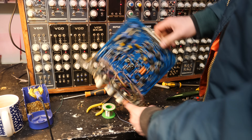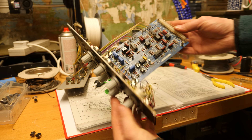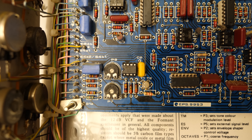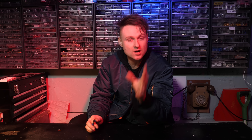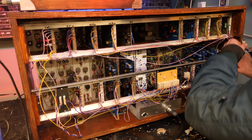I wasn't as lucky with this side — it took a fair bit of trying to get these to somewhat work, especially the voltage controlled filter which just wasn't working. I swapped a bunch of capacitors and chips while reading the schematic, but it was only when I compared it to the working one from the other side that I noticed this dual transistor package was wired in upside down. There's something to be said about repairing DIY synthesizers: even with a plethora of documentation, you can never assume it actually worked in the first place. This filter module would never have worked because the transistors were upside down, and the builder had tried various resistor value changes that I had to put back to normal.